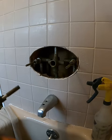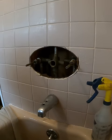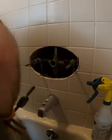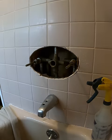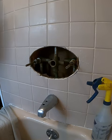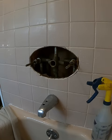So you did notice the spray bottle. I tend to keep the wall soaked. I actually make sure there's no paper. I reach up to make sure there's no insulation. I keep my flame on my torch as low as possible, so it doesn't really spread that far. And I constantly keep soaking the wall between every joint.